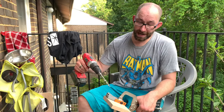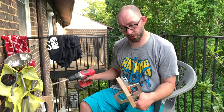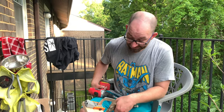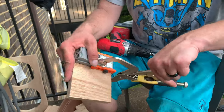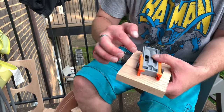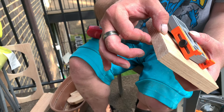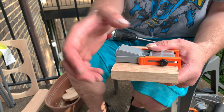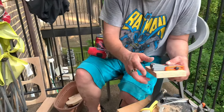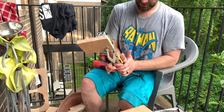We got our legs cut and need to add pocket holes so I can connect them to the top board. On the inside of your pocket hole jig there are measurements — you want to set that to the width of the material you're screwing into, so you don't go too shallow or too deep. There are special screws for this too. All you gotta do is clamp it on and screw it in.